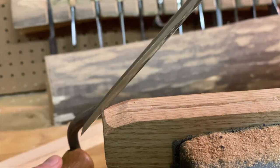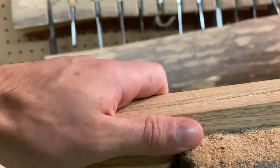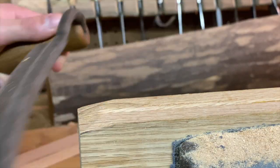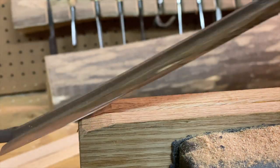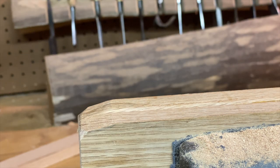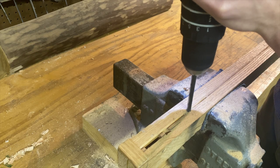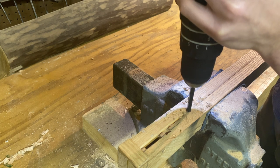After you get the device working smoothly, you won't see many jams, but at first, and especially if you forget to load a bolt before you fire, there's a good chance the device can jam. When you forget to load a bolt before you fire, about half the time the bow will jam the bolt into the magazine, and about half the time the bow will dry fire. As a quick solution for jams, I'll drill an easy access hole into the magazine. That way you can clear obstructed bolts.